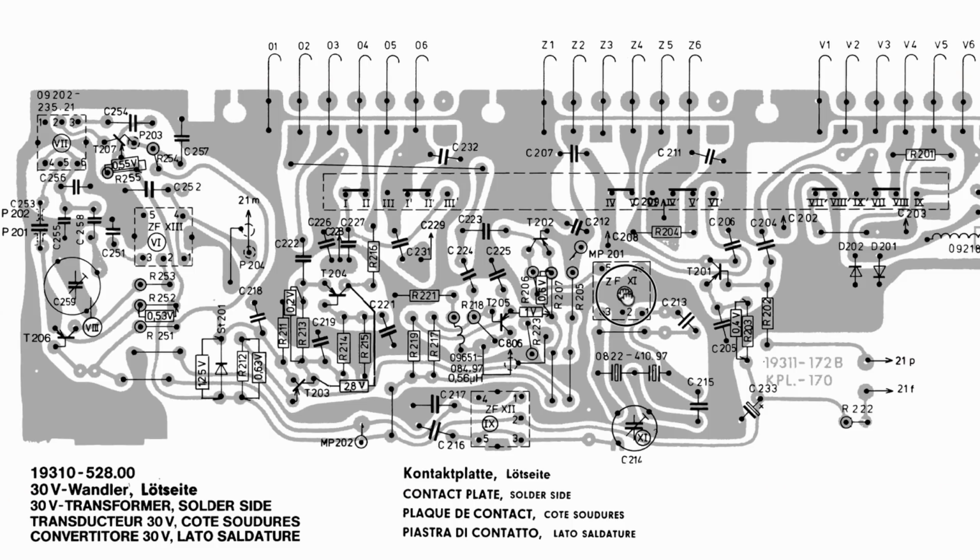10. Okay, here's 10. That's the one we're going to adjust first. There's MP201. Where is it? There. Okay, so the injection point is right next to that IF transformer, and we adjust that one, and we want to see a minimum dip over here. Well, I'm going to set it up and see what we see, because I don't know what we're expected to see. That's part of the fun.